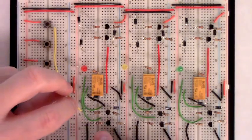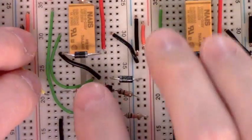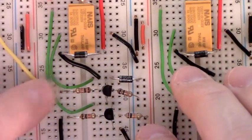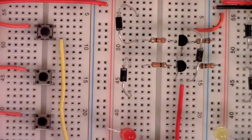The other piece of the wire goes into the slot — zooming in — into the row that this base resistor for the upper NPN is located. It goes right there, from here all the way up to the lower right-hand leg of momentary button A.